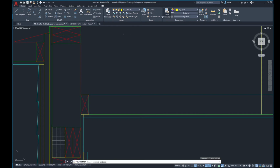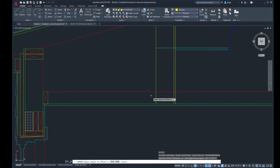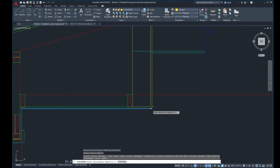So again, that's cavity line. And then this is an elevation line. So we're seeing the side of our 2x4 framing. And then we've got, you know what, I'm just going to mirror this. This will be easy. Midpoint between 2 points, between there and there. Gets us that piece of framing. This is cavity, so that ends there. And then this is material to material. And then that is our finish face, so that's our cut. And this line can get trimmed all the way back to here.